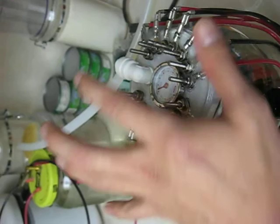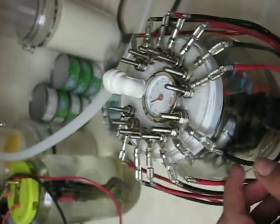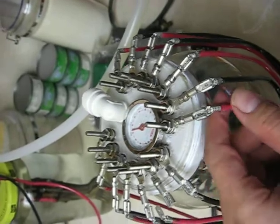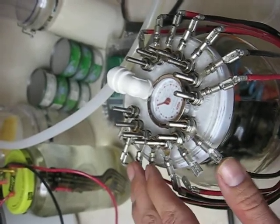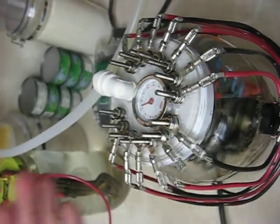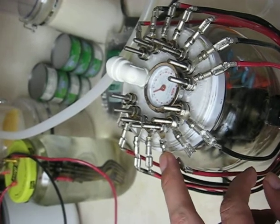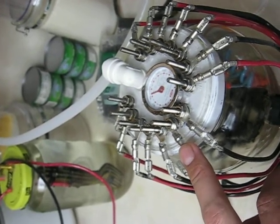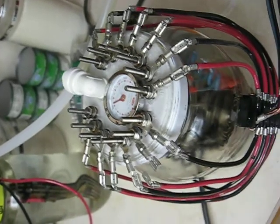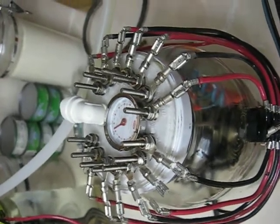Then positive and negative and so on. I also made it so that these connectors can be removed and I can try different configurations — moving the connectors around, having various neutrals and various positive-negative patterns. Instead of just every other plate, I can do a positive on one and then the negative on the third one and maybe have a negative in between them on the opposite electrode. So it's going to allow a little opportunity to try various combinations and see what configuration performs the best.